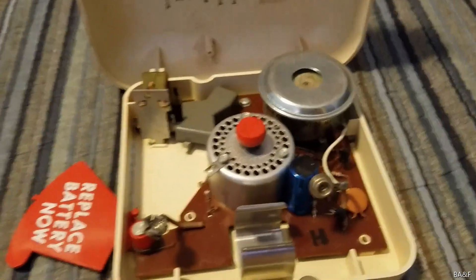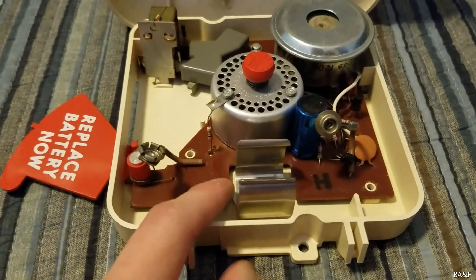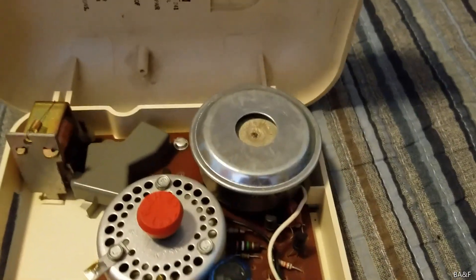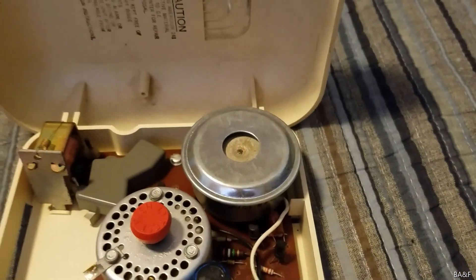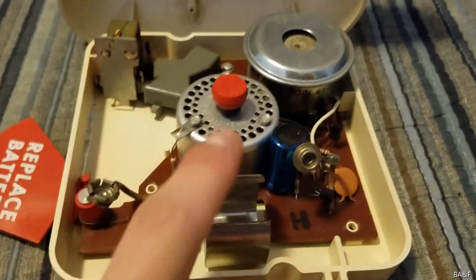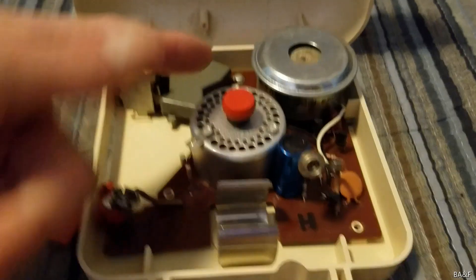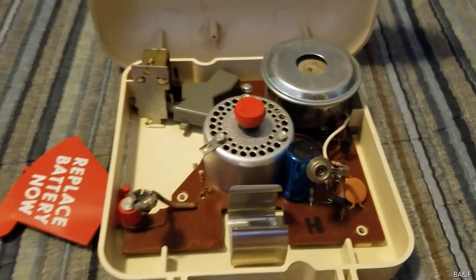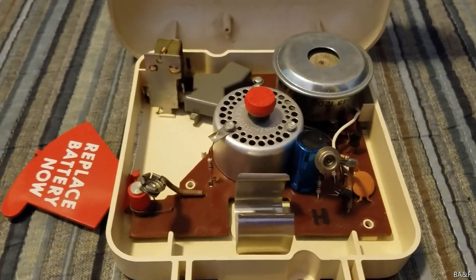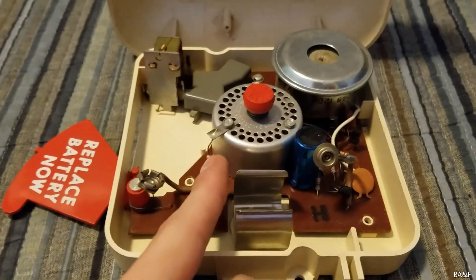Notice it has the older what we call the multi-hole sensor, as opposed to the later triple slot sensors — I'll show you an example of that later. It also has the Edwards horn, the Edwards squealer horn. Most of the multi-hole sensor units I've seen are paired with the Edwards horn. There are a few that have a Delta alarm horn — those are pretty rare variants. I've also seen ones with the Kobishi CLB-27, but all of those are 120 volt models and all of those have the later triple slot sensor.